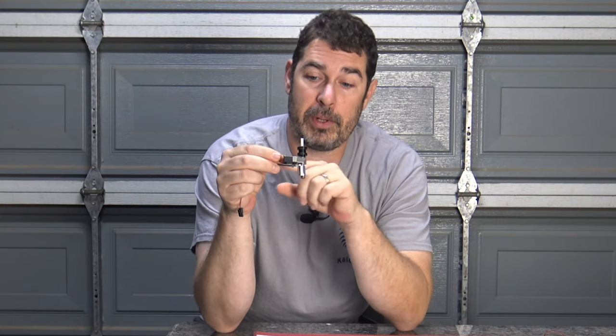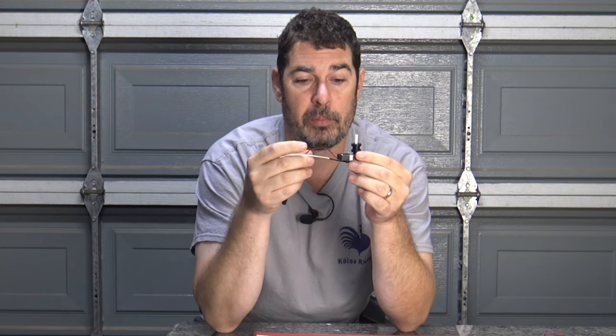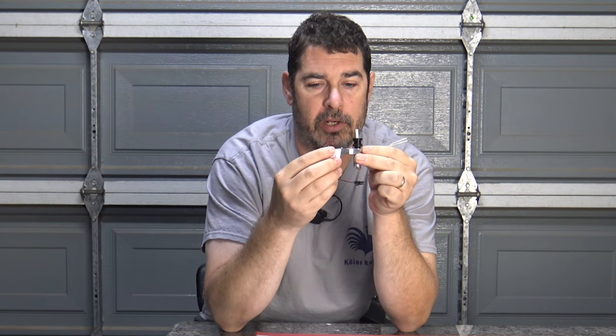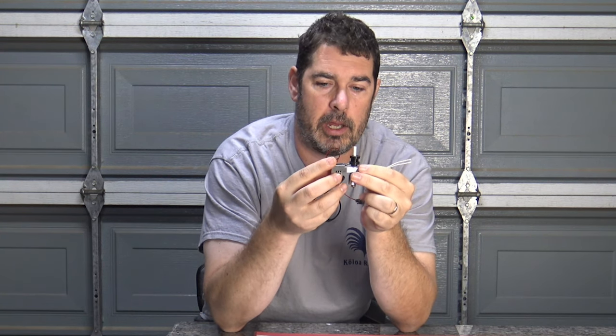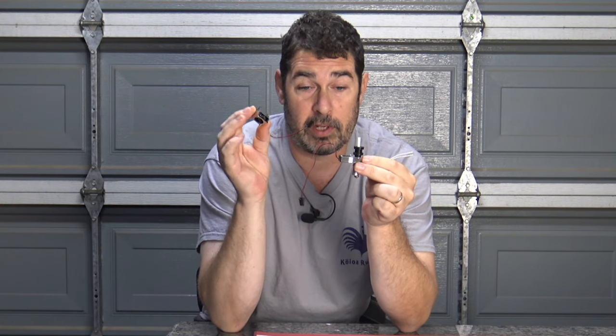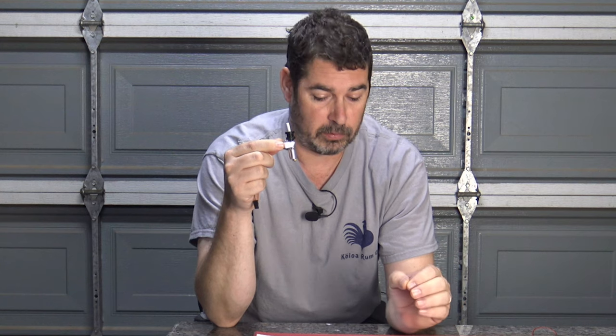A couple of things that are being held over from the original design and we'll see coming back later is the heatsink cooling fan here. This tiny little thing originally actually had a part cooling fan as well that just slid around it like so. It would slide over the front there, and had a secondary fan that would just go down and cool your parts. Unfortunately, it was found in testing that this didn't work as well as they had hoped. It cools one side of the print great, but not all the way around. So they're working on providing an updated integrated part cooling fan, but that will be a day two feature.